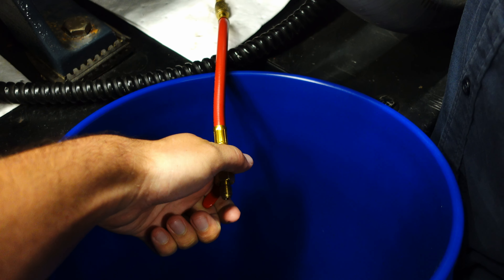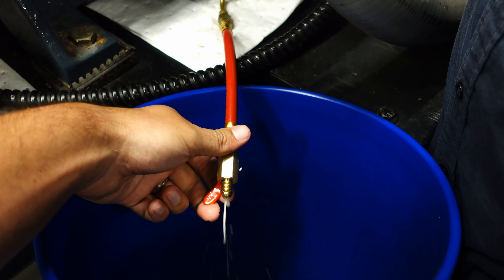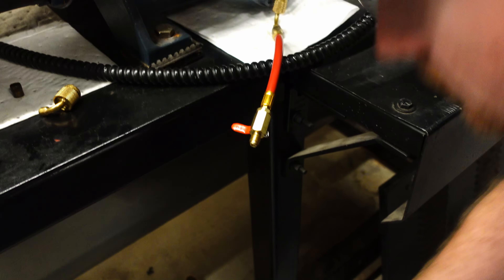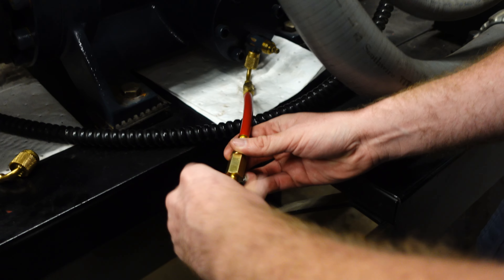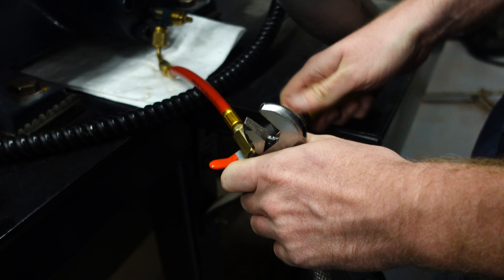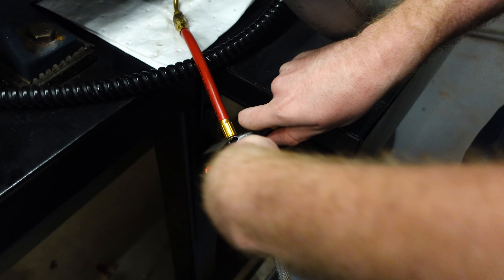Keep in mind, we'd consistently been running about 28 to 30 degrees of approach on circuit 2, whereas circuit 1 we were consistently able to do 24, 25 degrees without any trouble. It made sense that we probably had too much oil in the system, and what that can lead to is an oversupply of oil. The oil separator is not able to process that oil out of the refrigerant as efficiently as it needs to because there's so much of it, and that extra oil ends up stacking in the condenser, the evaporator coil, and other places.